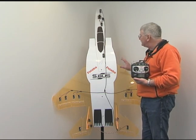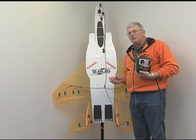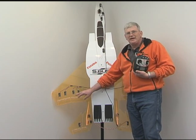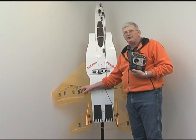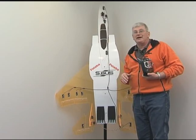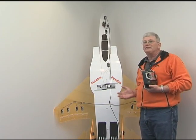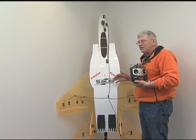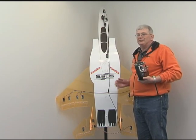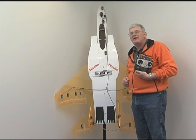You can see how nice and clean this installation is, how safe it is. I want to talk one more time about the PC-Link software. Again, using the USB interface, the CIU2 and the PC-Link software, I can actually program each of these servos. Let's say I only have a 7C — I can program each one of these servos for endpoints, center, and I can turn them into a retract servo. I can slow them down, which is what we've done up here — that's about a 4-second retraction time. That's not done on the radio; that's actually done on the servo by programming it. A lot of different features and options are available with this system. When you're assembling this system, you install all the servos, go back, use a little channel changer or the PC-Link software to tell them what channel they're on, and you're done. Hopefully we've shown you what the S-Bus system is like. There's a lot more to come on it. For Futaba Video Update, I'm Steve Califf. We hope to see you next time.